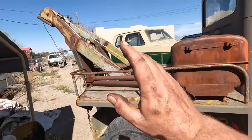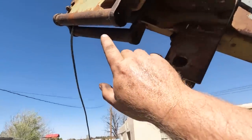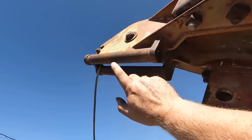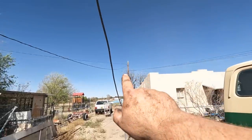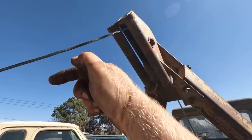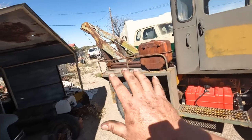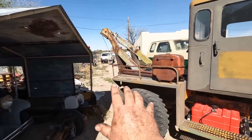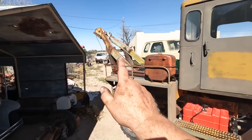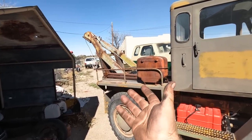I have the fair lead here to take down. There's a reason I went with the fair lead — not just the one big roller in the middle, but the side rollers too. This is why: because I'm going to be pulling sideways. That cable is going to be going that way on that roller, and these rollers are meant for side pulls. Because of the number of things in the way I knew I was going to have to do a side pull at some point. I'm going to give myself a win for this as a bonus win.